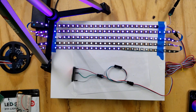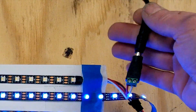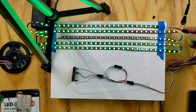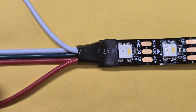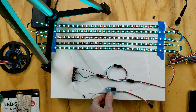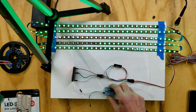If you're running Hyperion, you can disconnect the power from the LED strip itself and run it through this. On your LED strip you've got three wires plus two power injection wires, but they all go to the same point. Power injection at the start of the strip doesn't really make sense — do it later at the end of the strip or somewhere in the middle, wherever you start seeing colors and brightness drop out.